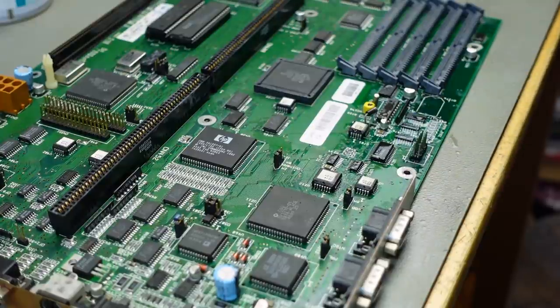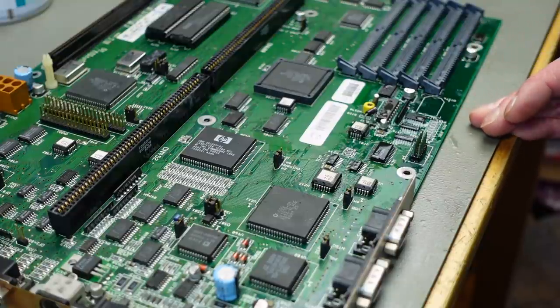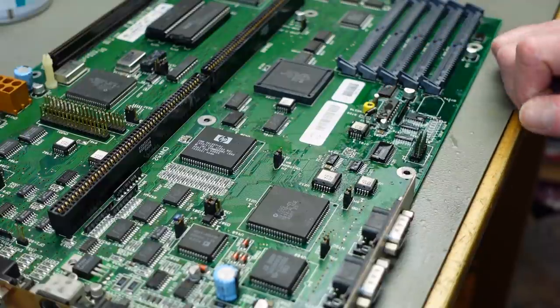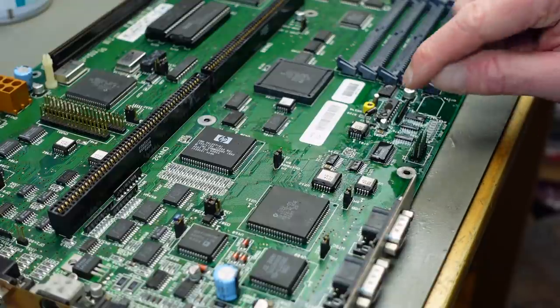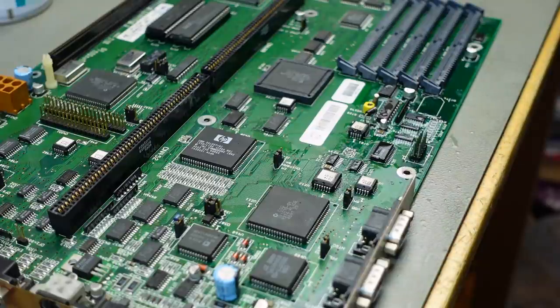And then our battery leakage should be neutralized, and we can continue to clean the area with alcohol and electronics cleaner and the things I used before, first rinsing it with water. And definitely have to replace the little SMD electrolytic capacitors. They seem to have all leaked. The contacts should be shiny and they're all dull. So all of them must go.